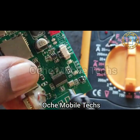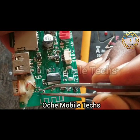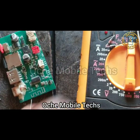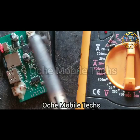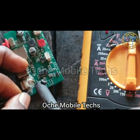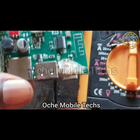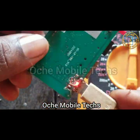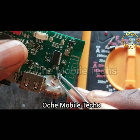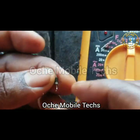I'm preparing the legs on the PCB. Now in this construction, please be careful. You can see these two legs are for the light indicator, and these other two are for charging — that is, for the voltage pass to the battery. I'm going to bridge those two legs together. It is five legs altogether. You can see the red light is now showing, confirming the bridge connection is working.